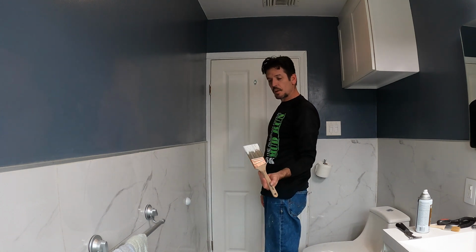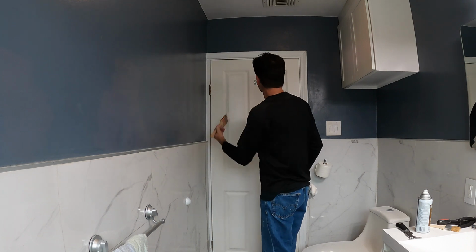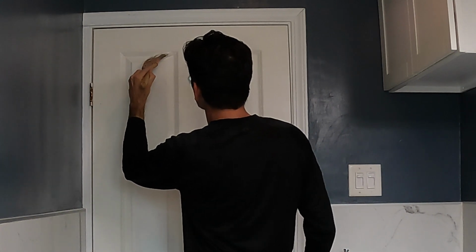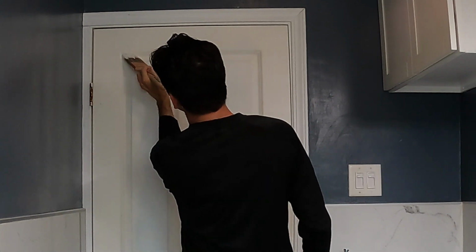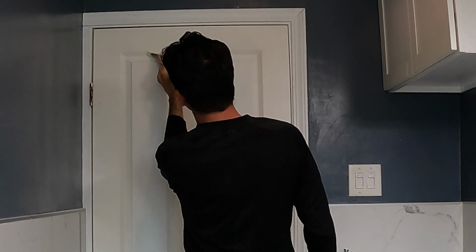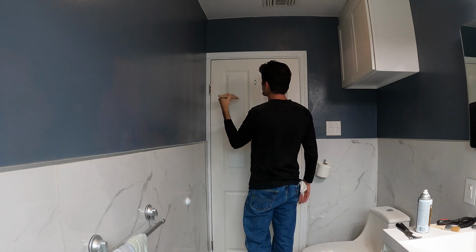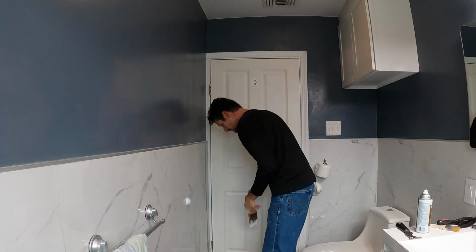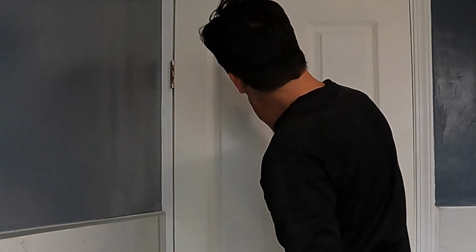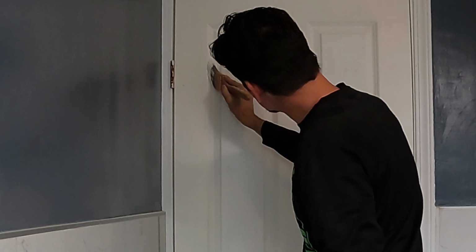So we get a couple taps, we get a little bit of paint on there. And I like to always start at the top, okay? So I'm going to start at the top. Just going to brush right in there. I'm going to cut along the top line. Go down, across, very lightly. Dip. Let's go ahead and take this down. So we're basically cutting in this edge here.